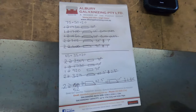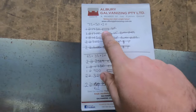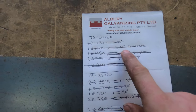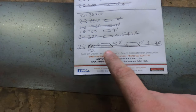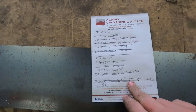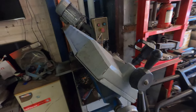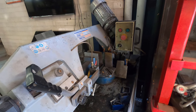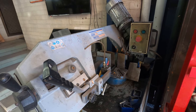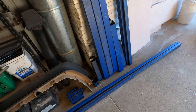What I've done is a cut list — as you can see I've written lengths and drawn my shape and angles. So 1700 with 14-degree cuts on both ends, 38-degree on both ends, some 42s and other sizes, and some tricky ones which are 35 one way and a 10-degree cut on the other. I've used my bandsaw to cut everything, but if you don't have one, you can do this with a grinder. I've already cut all my pieces so let's put them together.